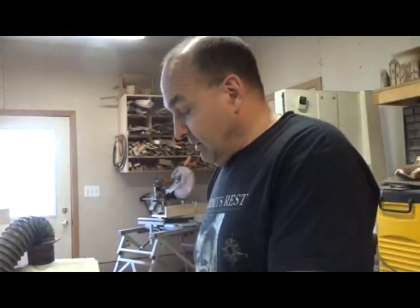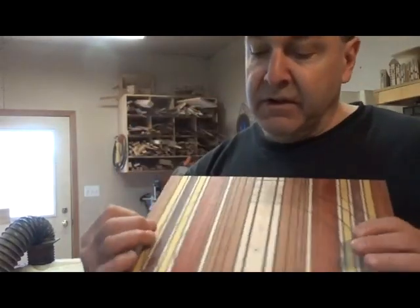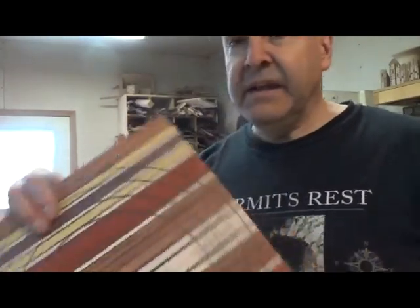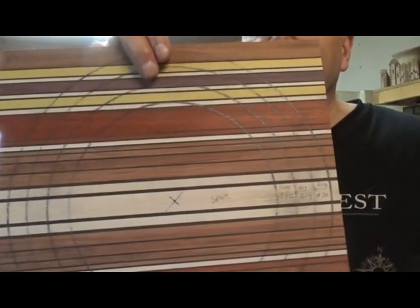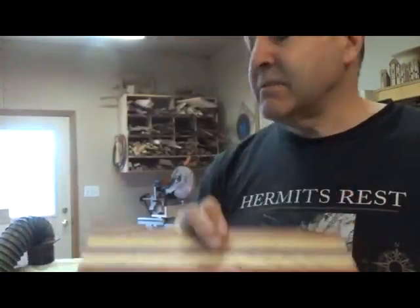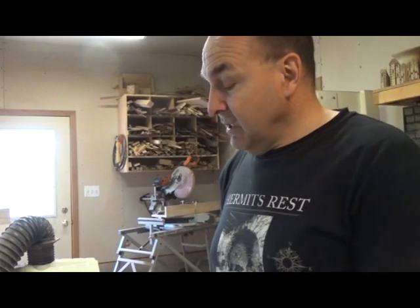What I did here for each panel, for each ring — here's a board where I've gone through and made rings, or the outline for what I need to cut now. Each ring I've numbered them, and then some of them, like this one here, there's a spare in the middle, so maybe I'll get another bowl out of it. I'm going to end up with a total of 36 rings if my plan works. I put a traditional closed segment base on this thing and I might put a closed segment top on it — we'll see when we get there.